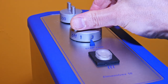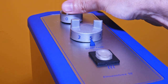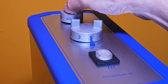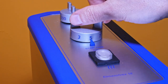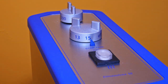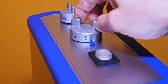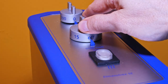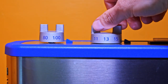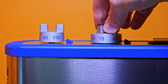I have some reservations about the knobs. I would much prefer if Elma — instead of the rotation speed being 0–100% — showed the actual speed. The manual states it goes up to 1200 RPM, and numbers from 1–12 would have been a lot more practical. If you look at Omega working instructions, they tell you to have it at 200–300 RPM. Markers on the knobs would be nice too, not just the numbers. Also, on the old machines the knobs were facing you, but on this machine they are on the top of the arm that swings more than 180 degrees, so you kind of have to twist your body. Not a deal breaker — it's doable, just a little awkward.